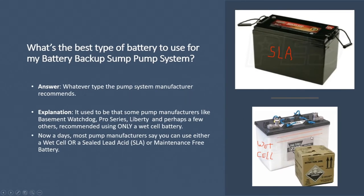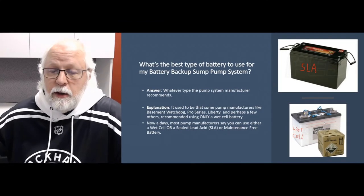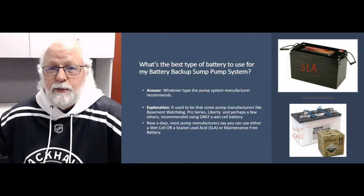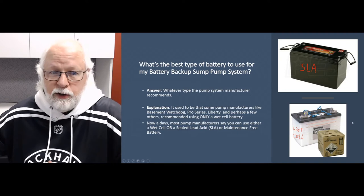The wet cell battery is basically a car battery. It has cells that you have to fill up with battery acid. Initially when you first get the battery, you fill it with that acid — it's a six-quart box of acid that fills each of those cells. Once you fill it with acid, that's the only time you use acid. Thereafter, if those cells start evaporating over time, you refill with distilled water or demineralized water to bring the cells up to the proper level. That maintains the proper pH levels and chemical composition for charging the cells and plates in the battery.